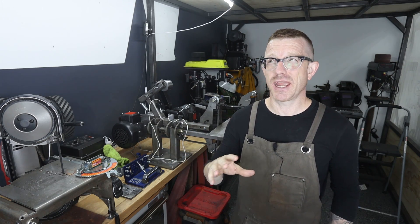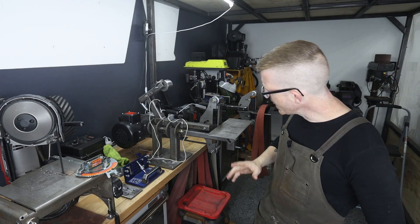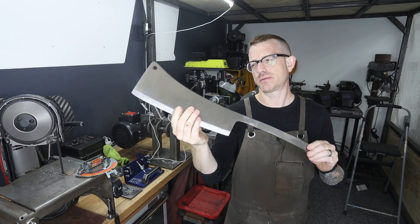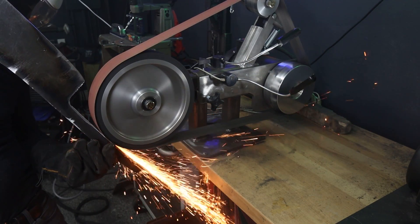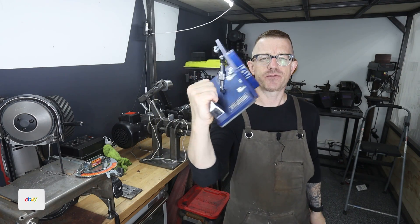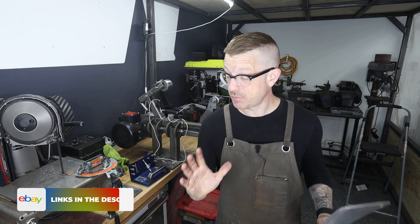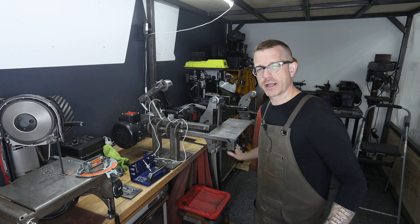In this particular case today I've got a necessity-is-the-mother-of-invention type situation. I am working on a nice big hog splitter cleaver — I normally don't do work like this but it's a beast to manage. In order for me to get these perfect grind lines I'm using this TR Maker sophisticated bevel jig. This bevel jig is fantastic, but without the proper work rest — it has to be long enough, big enough, and straight enough — you're not going to get really good grind lines.